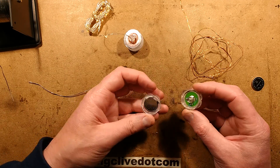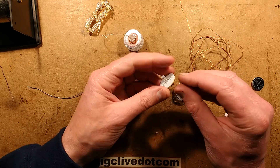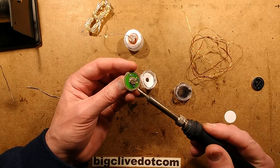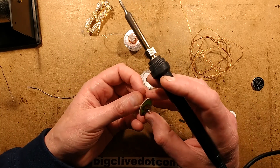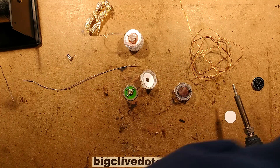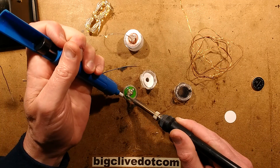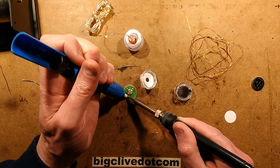So we'll take this apart. These are available very cheaply online — they're sometimes called vase lights. This one is rather nice; the wires go to the outside of the spring which makes it more accessible. I'm going to heat these solder pads and desolder the LED by pulling it out while heating it, then I'll use a solder sucker to get rid of the excess solder. Heat the solder up and suck — heat the solder up and suck.